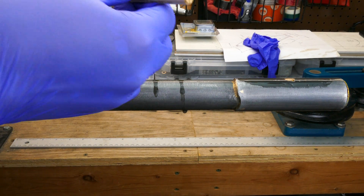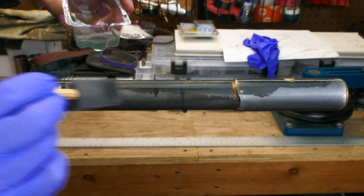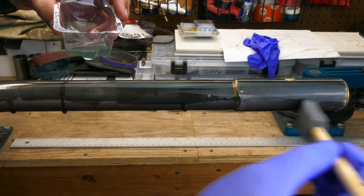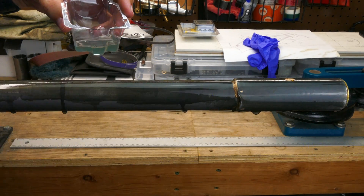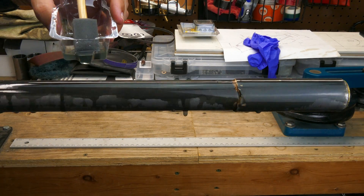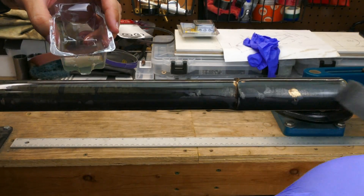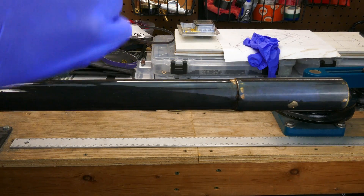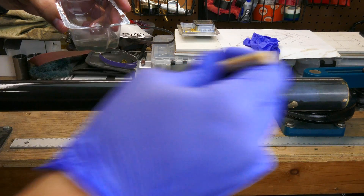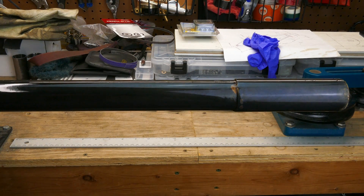Cold bluing is a pretty easy way to finish a frame — no priming needed, you don't have to worry about it being too thick, and you only need two or three quick coats. There are different types of bluing, with cold bluing being the easiest but also the least rust-resistant. The other types that provide more protection aren't really accessible for the home hobbyist frame builder, because you need to soak the frame in hot, acidic reagents.